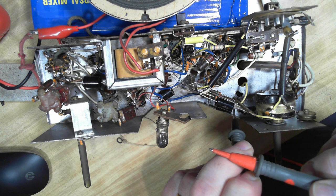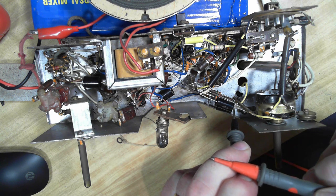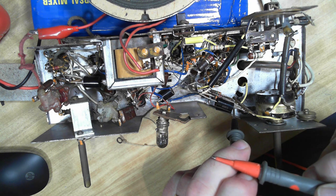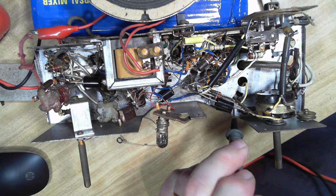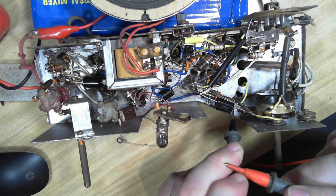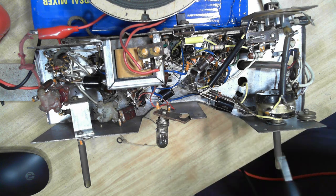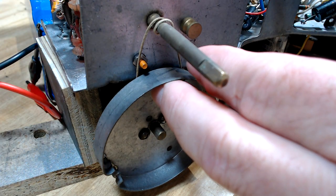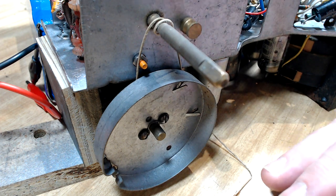So I don't really know what else to do about it. It's working all right. It's well within the limitations of the valve itself in the specifications, so I can't see I can do much else about it. I checked the bias resistor, that's correct. So, in light of not having any other ideas, I'm going to move along. As I say, the radio's working fine, so I don't think there's an issue. So I'm now going to replace the mounts for the tuning capacitor, and I'll restring it.